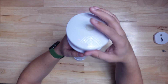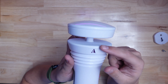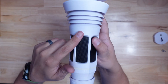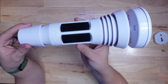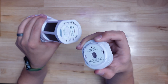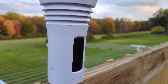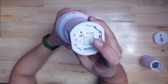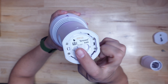If we take a look at the sensor unit, you have the top of the device where the haptic rain sensor resides. You have the wind gap with the four wind sensors where wind speed and direction are measured, and then the section underneath where the temperature and humidity sensors are. The black patches on the side are solar panels which keep this thing charged. On the bottom there's a pre-installed flat mount that you can remove, so you get two types of mount with this device: the flat mount that can be screwed to something horizontal with the provided wood screw, and the compression collar for a one-inch pole mount. Under the mount you have device information including the device ID, which you'll definitely need later, and also the switch to turn the unit on.